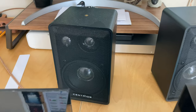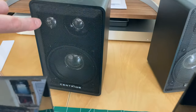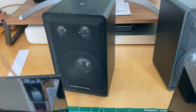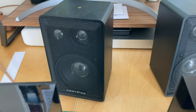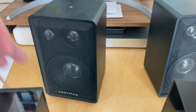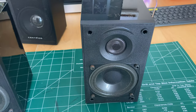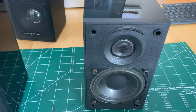I have no idea what the crossover frequency would be for this piezo tweeter thing. My guess is it's a single capacitor which just provides a high-pass filter — that's usually the approach taken with tweeters on these things, and you just let the woofer trail off. These have a real crossover, a simple one I'm sure, but certainly a significant step up.